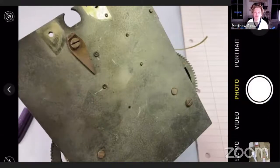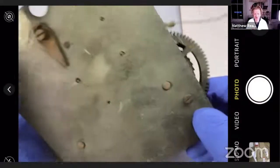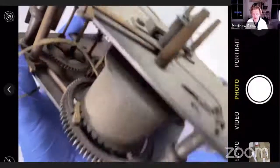Top tip, when you're transporting a clock and you lie it on its dial, that's the way I do it, with paper behind the hands and things. Take the bell off, because the bell standard could easily snap off. It sort of gets work hardened. So they're things that are all right. I mean, there's surprisingly little kind of wrong.